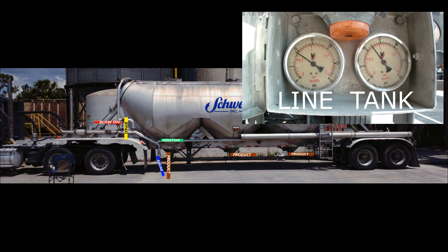So whenever I did any other type of product, it will only take about 40 minutes to an hour to unload, as long as the silo exhaust filtration system, bag house or dust collector, relieve the pressure just as quick as being pumped in. Sometimes I would have to set my RPMs much lower on the blower, so the bag house can relieve pressure just as quick, usually when I did cement loads. If you have a powerful blower, you may need to lower your RPMs at different plants.